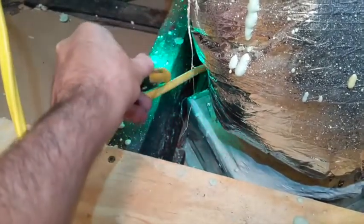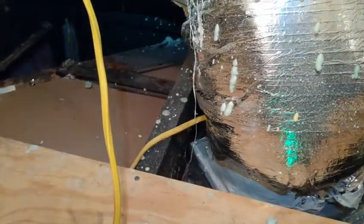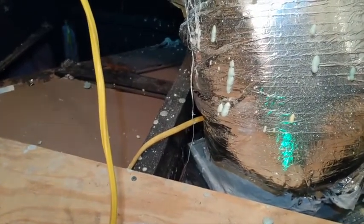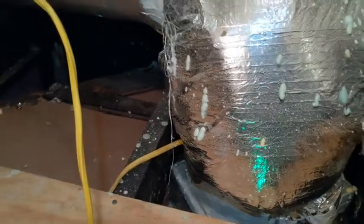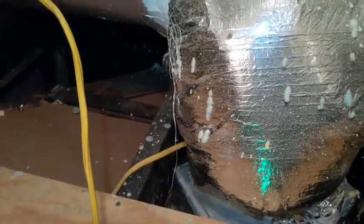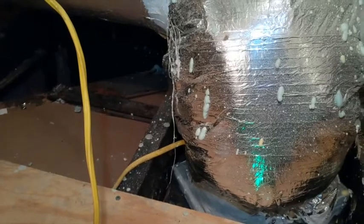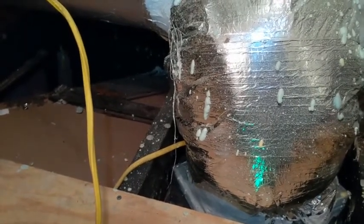That only took five trips — now we know that number 14 in my circuit box is this line. I'm out of breath from going up and down the stairs. It's much easier if you do this with a friend. Number 14 is the breaker that controls this wire as well as the outlets in my bedroom. In one of these old houses, it's always good to write that down, so I'm going to go write that down in the breaker box.